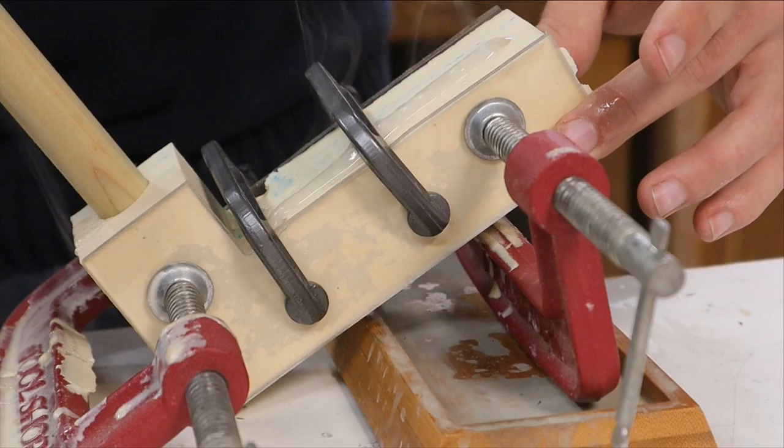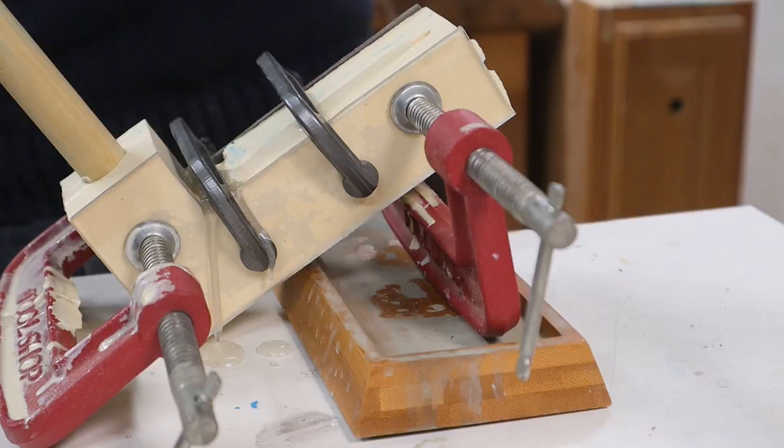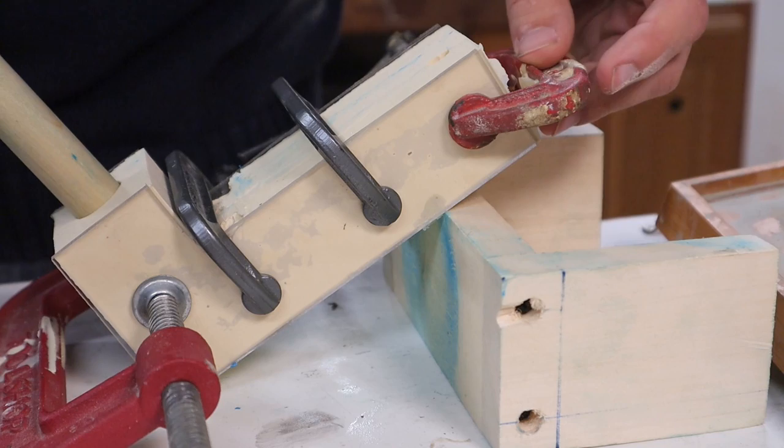That's not gonna turn out good. I didn't wait long enough to let the mold release that I sprayed in it dry and it got all bubbly. We'll try that again. So I added a taper to the end of the plunger rod so all of the air can escape where the injector is, and then it'll inject into the bait. I think that'll help.